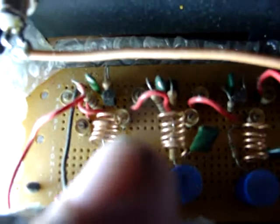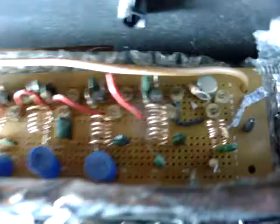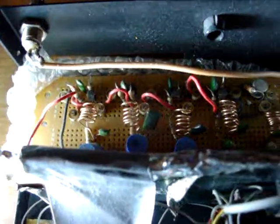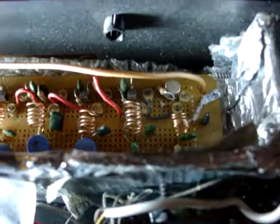Notice each stage has trimmer capacitors. I found that if you don't use these and you just connect it together like you'd connect anything else, it doesn't work or works very inefficiently. In my case I hooked a one-megaohm scope to it — since most scopes are one megaohm — and it did not work whatsoever.